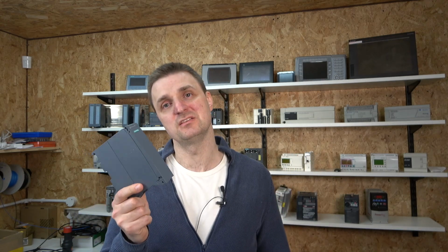One more good trick that I want to tell you about, guys. If you bought this ET200 MP card used, there is another one we're going to be checking out in the future, which is the ET200 SP. So you must reset it. The key is to do a full factory reset, and then assign your IP address, which I'm going to show in a minute. Everything's going to be shown in the video, but with this one key thing, we must reset it. Otherwise, you'll definitely have problems. So that's what we're doing today. Without further ado, let's get started.